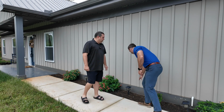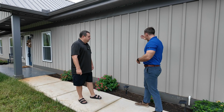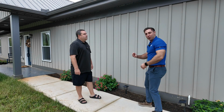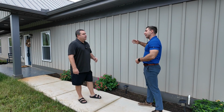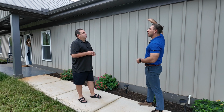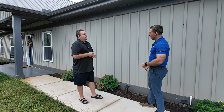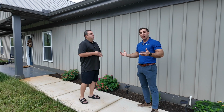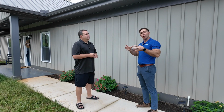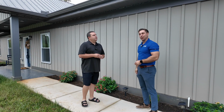Yeah, so you got a board down here, and that board was just wrapped, so we're protecting the wood down at the base. The board and batten panel sits on this piece of trim, which has a little bit of flashing that goes up behind the panel to make sure that we're waterproof down at the bottom. And then we've got an oversized double angle up at the top to give you that bigger border trim that matches the width of the trim at the bottom. It's sometimes called picture framing, where you have a really nice perimeter. You've got complementary outside corners that are a little bit larger that make the wall look like it's encased by a picture frame. A really cool design here.